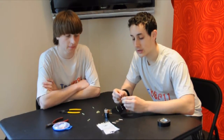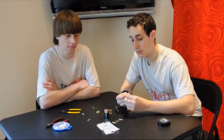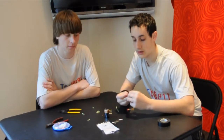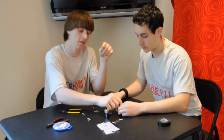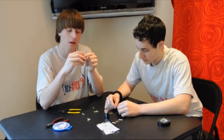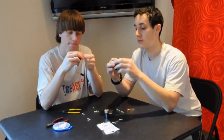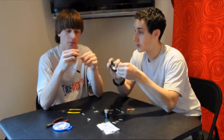We're going to start by not connecting it to the battery, because there's a risk you might electrocute yourself, and that's not a really good idea. First thing we're going to do is attach the negative end of the battery connector to our switch. That way, when we want to, we can actually make the circuit break so we can turn on the flashlight without separating it from the battery. Next, connect another wire to the other end of the switch — not the other wire from the battery, a different wire. We're going to wrap both tips in electrical tape so that nothing gets shorted.